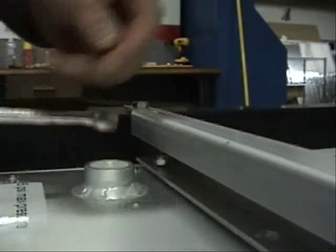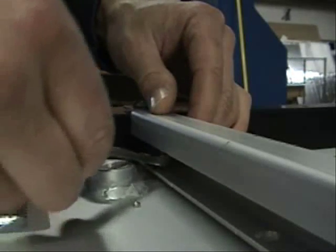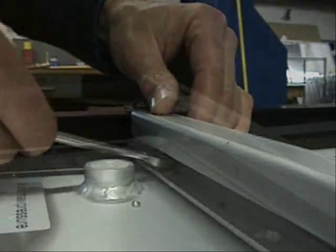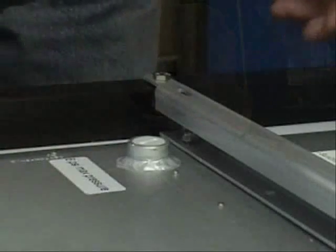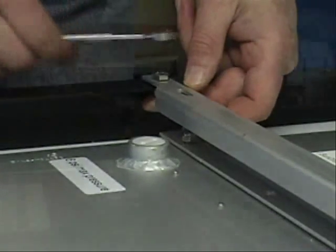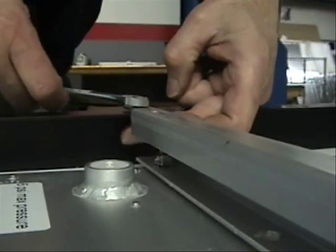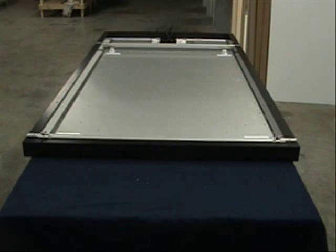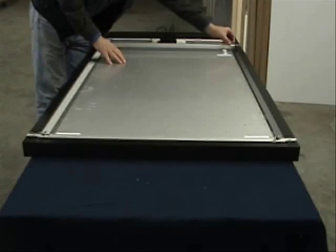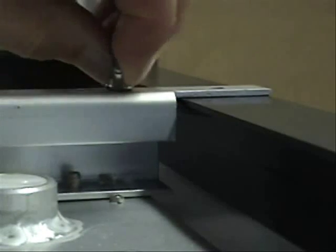After verifying that both brackets are in position, take the 3/8-inch wrench and tighten down the lock nut in the upper bracket slot. With the 7/16 wrench, tighten the 1/4-inch nut and bolt. With the grounding hardware secured, make sure the Sundrum panel is centered within the PV collector frame, and then tighten all three clamps using the wing nuts.